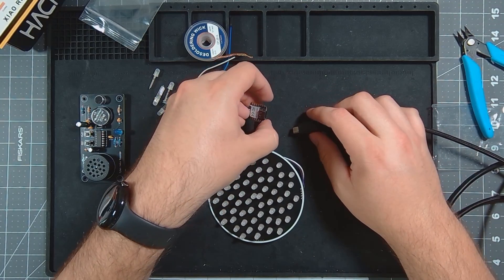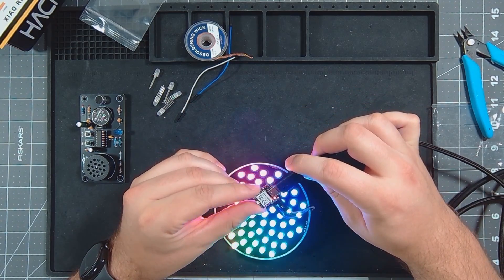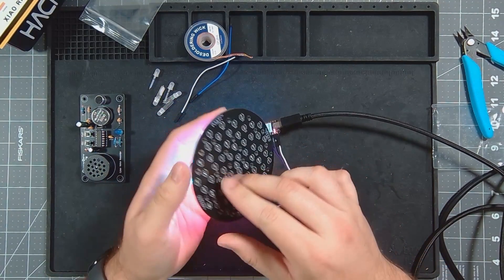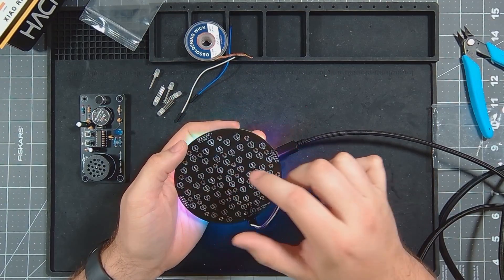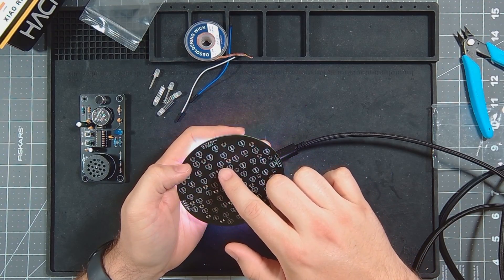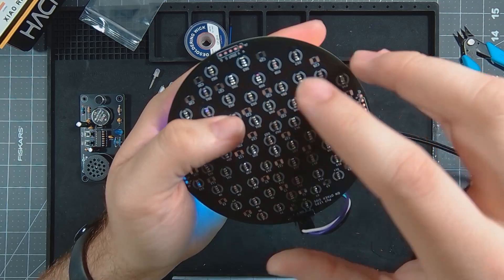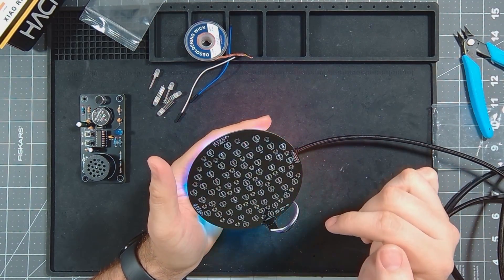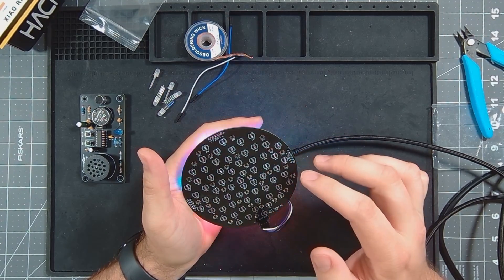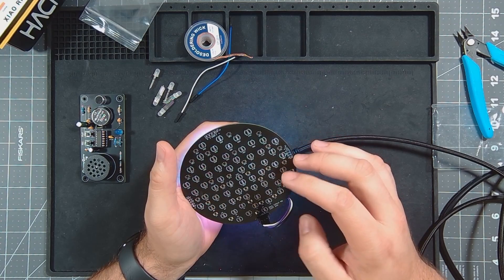Then we had our Fibonacci Raspberry Pi 2040 by Seed Studio — great little project. A few things on this: it takes a steady hand and lots of patience soldering each one of these. The pads are very close together with very little space in between them. I have a few places I need to go back and touch up. Make sure that you don't have any shorts. I had a short and it was causing over-voltage on my USB port, which caused some unnecessary troubleshooting.